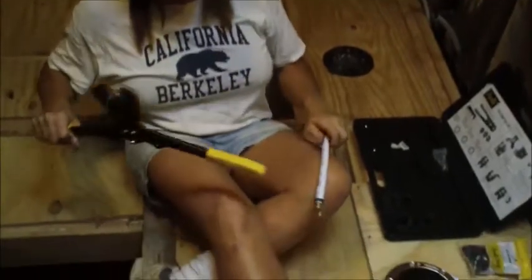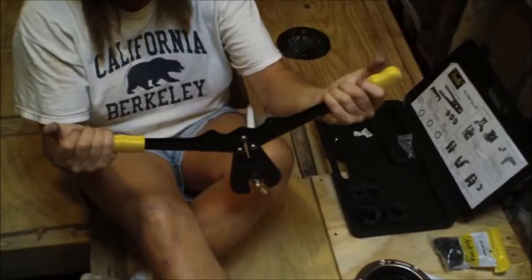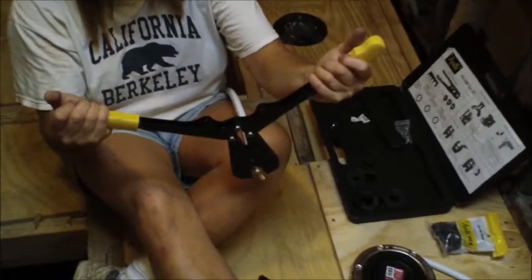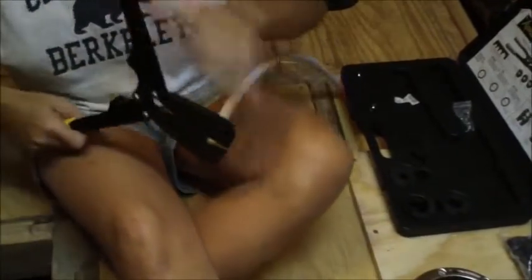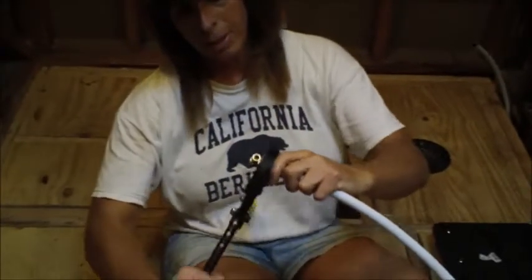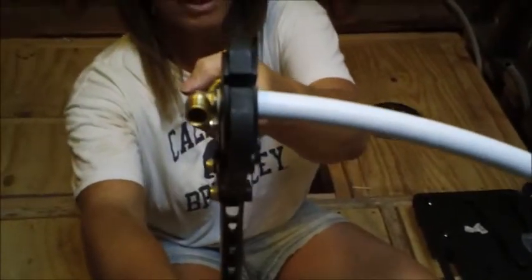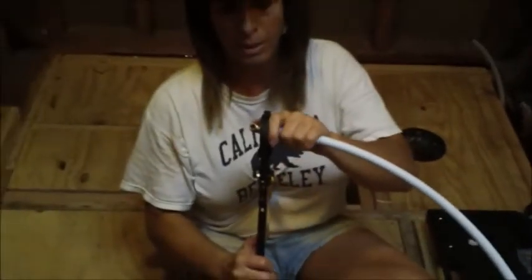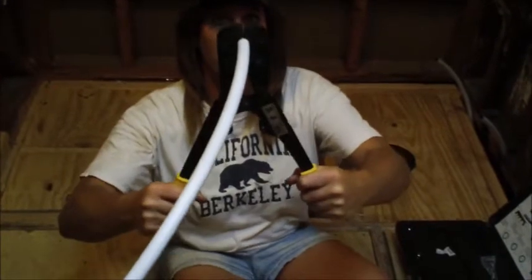I already have this set for half inch. You can see what I call the 'jaws of joy' for the PEX system. I'm going to place those jaws over the crimp ring, open them up wide, set them down on top, get them positioned real good. Make sure it's square — you don't want it on an angle. Then I'm going to compress that fitting.